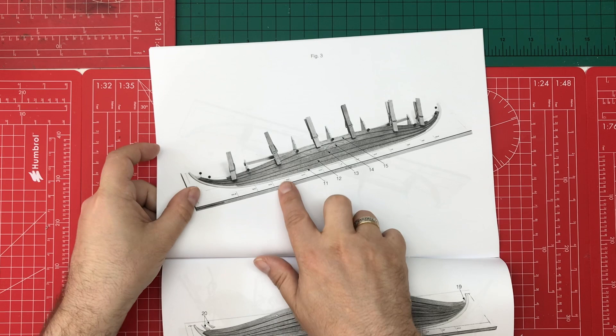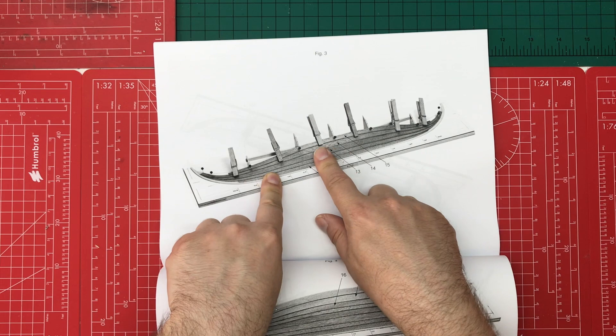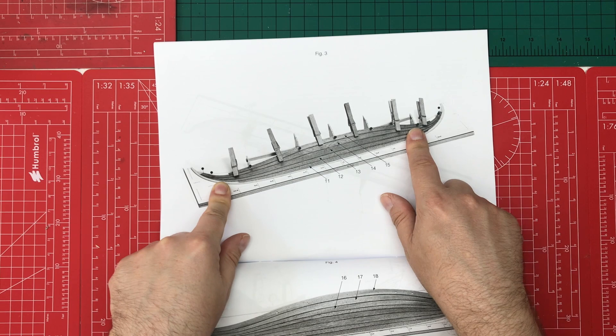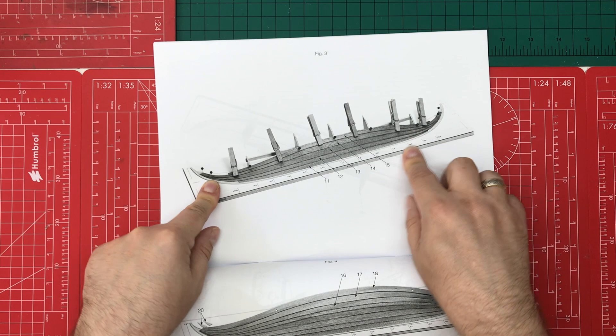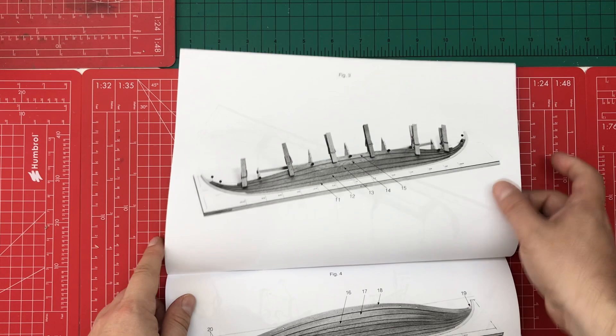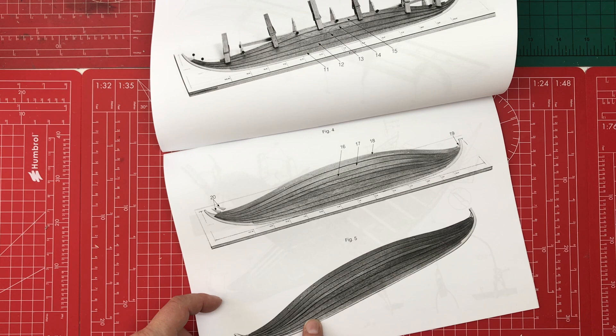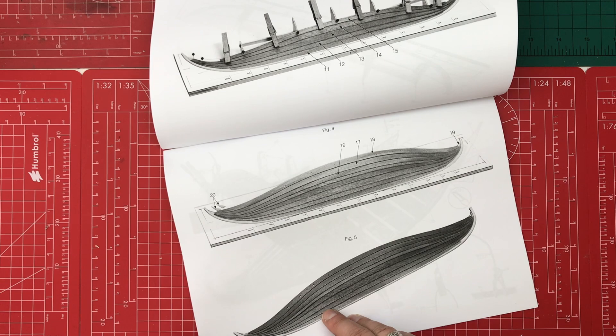It then shows you pinning individual wood strips to each former. Some strips finish early and that's why they're tapered — to allow them to form together. By pinning and pegging them into position, you can mark them out with a pencil, bend them into shape, apply glue, and fix them in place. It's a lovely shape being built up — really nice. Then you lift it off and you've got it glued to the basic keel piece.